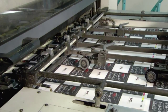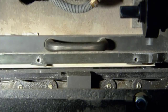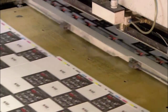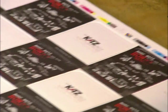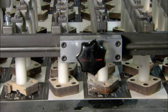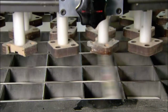The borders of the images must line up with the grid of blades on the die cutting machinery. If the alignment is even slightly off, every coaster on the sheet would be ruined, as the die cutter punches out the coasters — dozens of them in one swoop. The coasters end up over little chutes, and pushers give them a nudge, sending them down to land neatly on a pallet below.